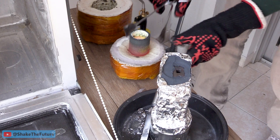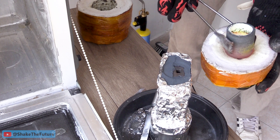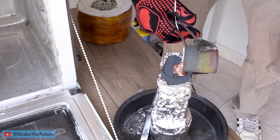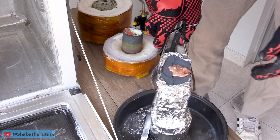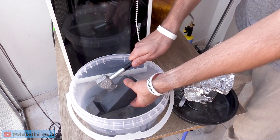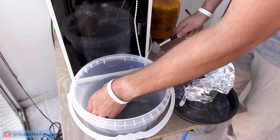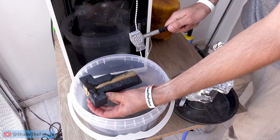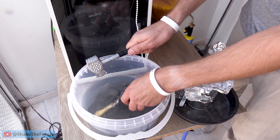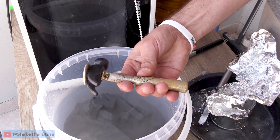I made at least two mistakes. I let the metal cool down way too much while I was playing around with the right camera angles. And the second issue — the mold was cold. That hammer head is like a heat sink. I was pretty convinced that the cast had failed. Let's see the result — there were some temperature-related issues.